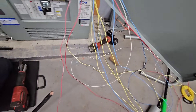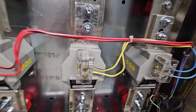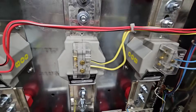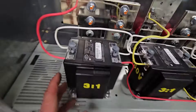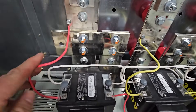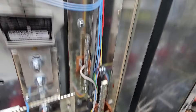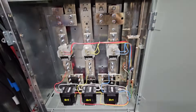They do have the pipe inside now, so I can carry on with my work, pull through all those new wires - and just fast forward 45 minutes or so, we've got everything wired up here. Those are the CTs. I was taking a look at that brass clamp - nothing's energized here now, so it doesn't really matter the position of that, but before it is energized you do want to make sure that clamp is open. PTs are wired up like a transformer: you've got the source side wire, 360 volts coming to each end off the H1, and the H2 carries off to the neutral. On the secondary side, the load side would be the meter - so your X1 and X2 would be your hots and your neutral going to the meter.